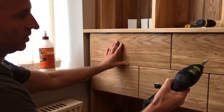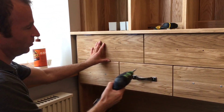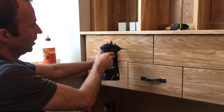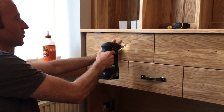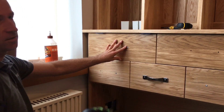We've pre-drilled with a 4.5 millimeter drill for our handle holes, which take 4 millimeter threaded screws. The 4.5 just gives it a little bit of play if you're not too precise. We use that to screw tight into the draw box.